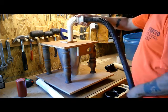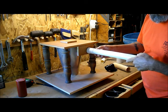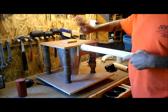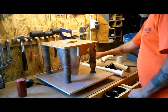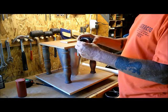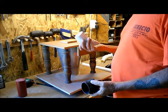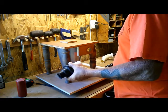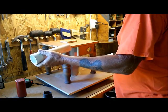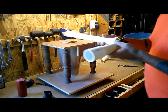That takes care of the top. This pipe I'm going to cut at an angle and stuff in there at a wide angle, because I want it to push all the particles up against the wall right away and start slowing them down. This goes into the back end of your table saw. This PVC - it's inch and a half - is exactly the same size, a nice fit. I'm going to put this in the back of the table saw, along with another piece of plumbing pipe to reduce it down to connect here.